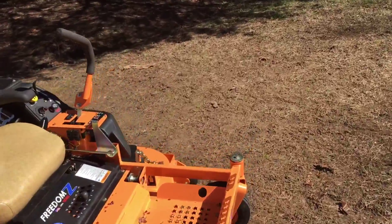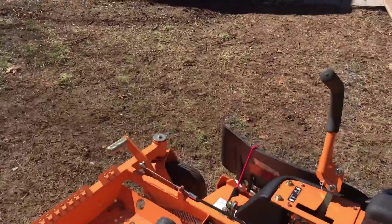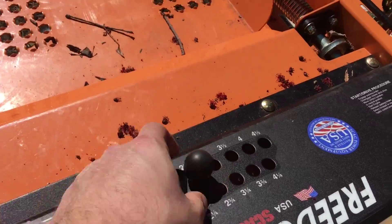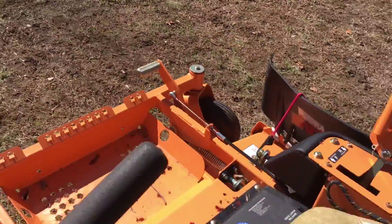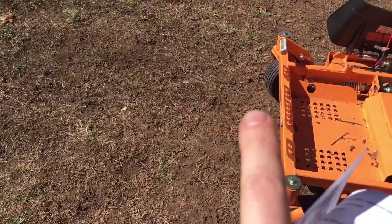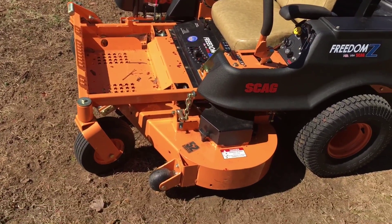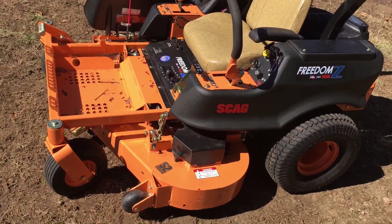This one does come with adjustable deck height — you set the adjustment by the pin, you pull the pin out and that sets it. To raise the deck you press that silver pedal with your leg and the deck comes up. So if you're mowing and you see an object in front of you, just press it, the whole deck comes up in the air, you can go over it and put the deck back down. You can stripe right over a little rock — you don't have to go around it.